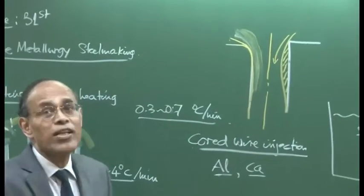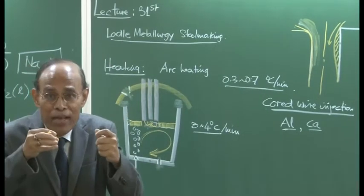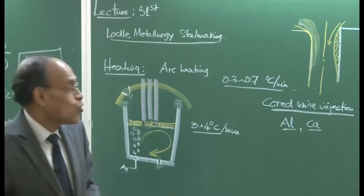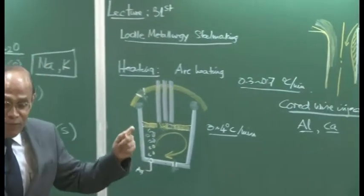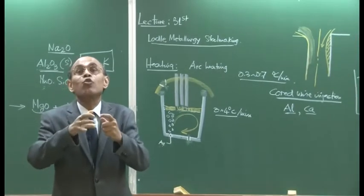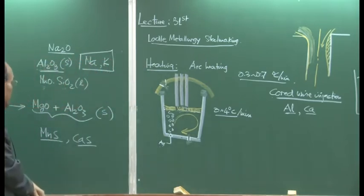Particularly for certain cases when the nozzle diameter is small, the deposition can be so severe that nozzle clogging can take place, that is, no material can now flow. So, continuous sintering of the inclusion particles onto the refractory wall can eventually lead from a constricted nozzle to a completely choked nozzle, okay, and this phenomenon can actually jeopardize the steel making operation itself.